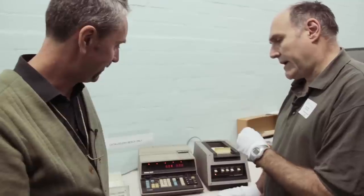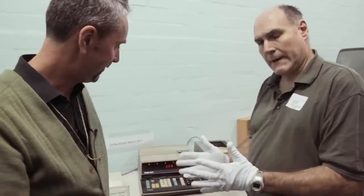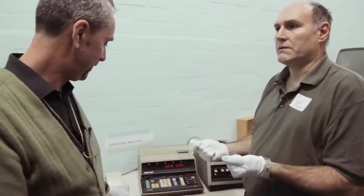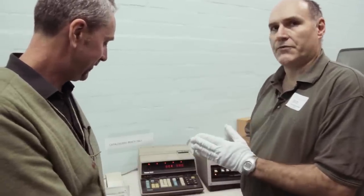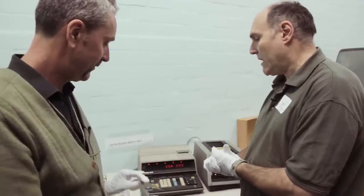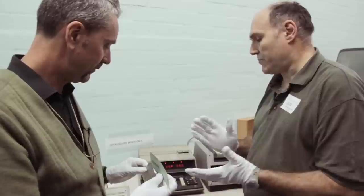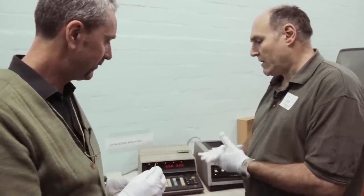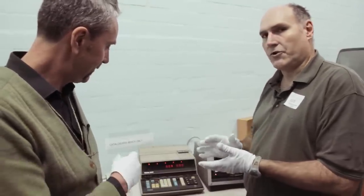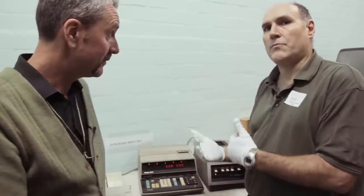The way electronics like this works is that they tend to have an internal state. If you're entering a number, before and after the decimal point has a different meaning, and the display operates differently depending on whether it's before or after the decimal point. So the machine internally maintains a state of whether it's before or after a decimal point, so that when you press a digit key it does something subtly different. That state machine — it's called — isn't documented in the manual. You can only infer its existence and the states it can assume from the instructions.